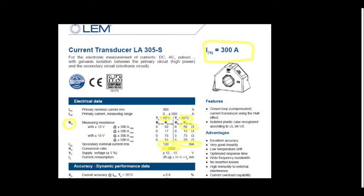This sensor works on the Hall effect, and we have complete isolation between the high current side and the low-voltage logic controller. The microcontroller works with low voltage, so it is important that the high current is completely isolated — and this sensor provides that high isolation. This is how we perform high current measurement using a Hall effect current sensor. If you like the video, please share with your friends and don't forget to hit the like button. Thanks for watching.